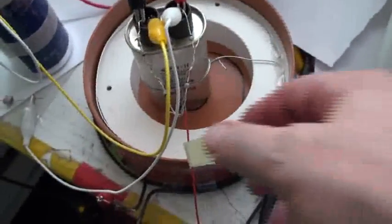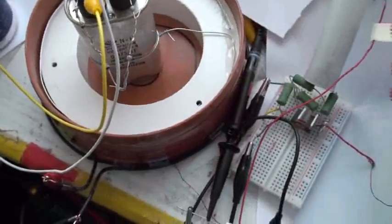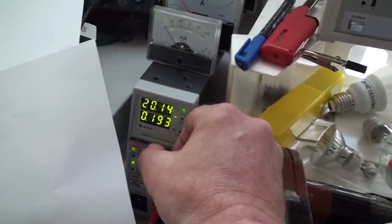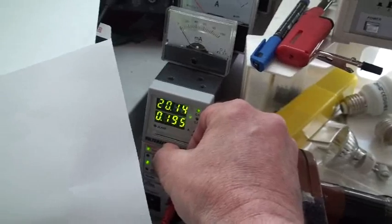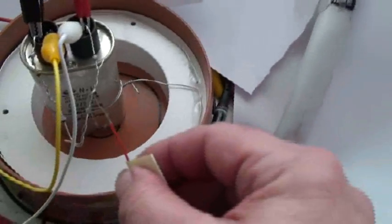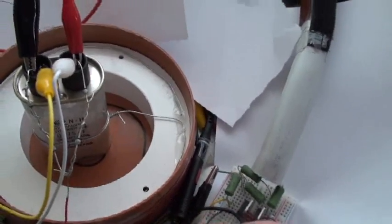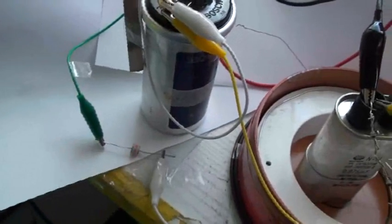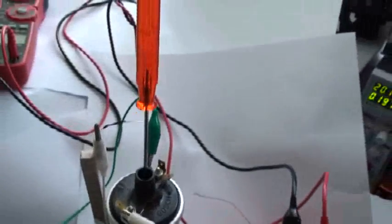First of all, I will disconnect the ground. And now I will put the power. I put 20 volts, 194 milliamps. And nothing happened. Now I shut down. I will connect the ground — I connect the ground here on the AV plug. And now I put the same power. Hey! And what happened? Nice spark here. And the EPCOS is lighting. I am very happy with this.